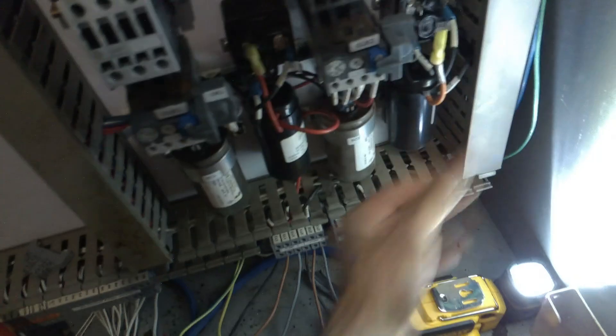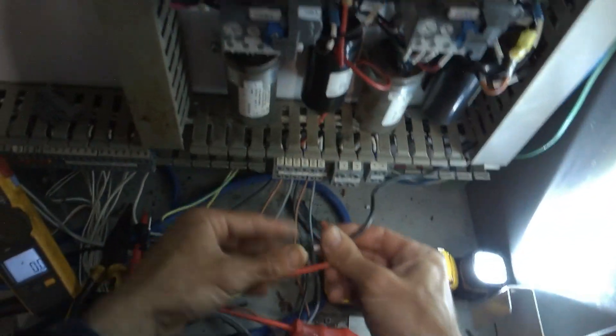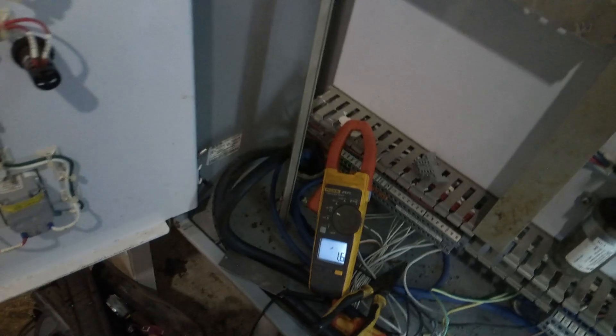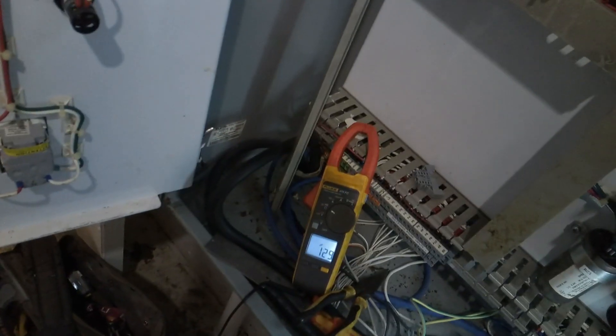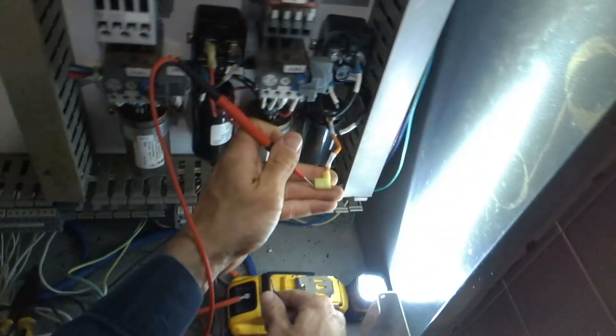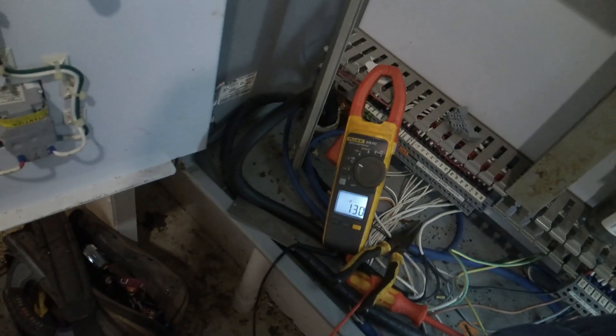One at a time, slowly getting there. I would think they'd have three-phase all over this place — it's kind of surprising they went with a single-phase panel, but I'm not an engineer. The working pump's start capacitor reads 130 microfarads — nice and strong. Yeah, that might be our problem right there. He shows 130 — let's just double check that. Yeah, 130 microfarads. Very good.